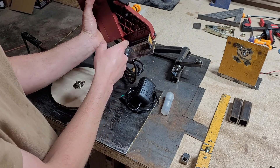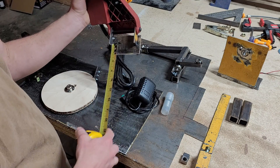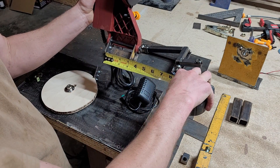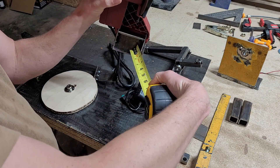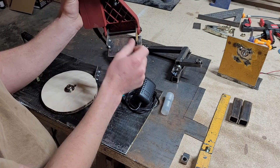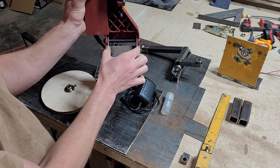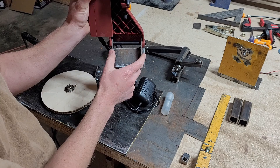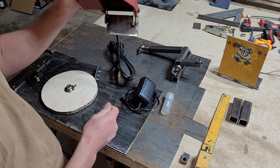Starting off, there's a snap ring on the side of this pin here. You pop that snap ring off, pull the pin out, then remove the base from the chainsaw sharpener. This bracket is two inches by three and a half. These little tabs are two inches tall by about three-quarter inch wide. I measured it with the calipers and drilled out the holes. I tried to weld these tabs as far apart as possible so the sharpener has as much stability as possible.